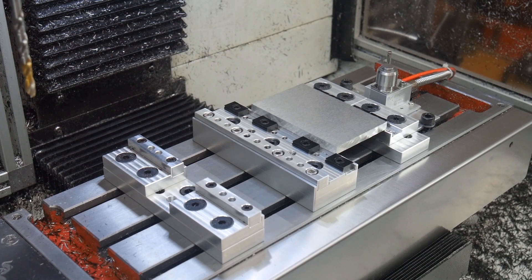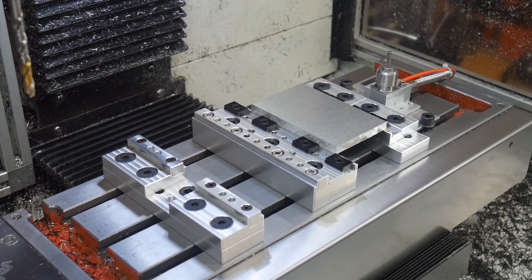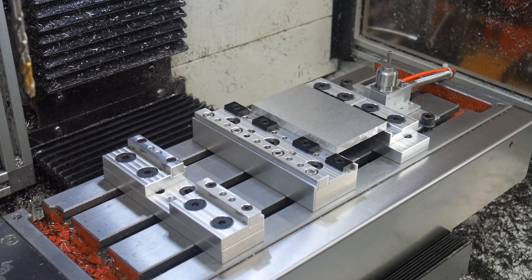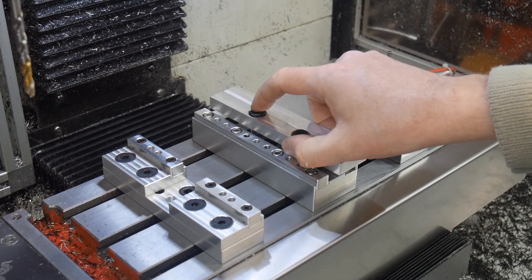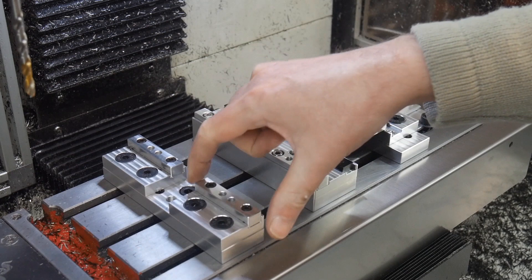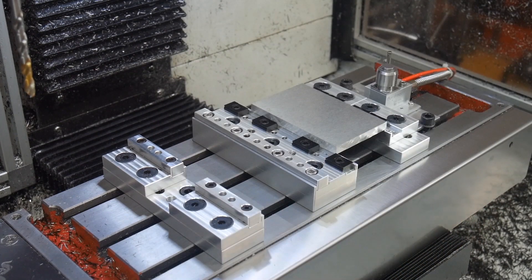As an option, on the centre, if you take both the talon grips and the alloy bar out, I can fit that instead to do a soft jaw. Or if you want soft jaws on one side but talon grips on the other or whatever, there's a half-wide soft jaw. For soft jaws on the moveable side, I would simply make one of these without the channel, so it would be a solid piece of alloy. Not difficult to do.